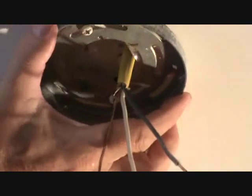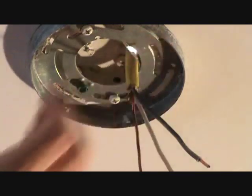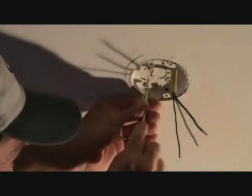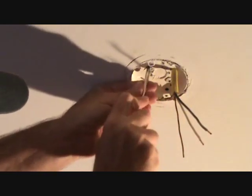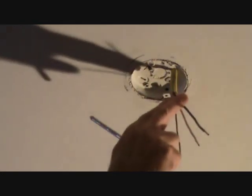So now this box — wow, it's even loose. I'm going to just undo these two screws and pull this down, that way when I patch and get ready to paint I'll have this out of my way. It would be much easier to just get that out — just two screws are holding it. At this point I'm going to make sure the mounting screws are tight in there. And they seem to be — oh, that one's loose. There. If that was on a ceiling fan or a heavy light fixture or a chandelier, I would have been glad that I just tested that out.